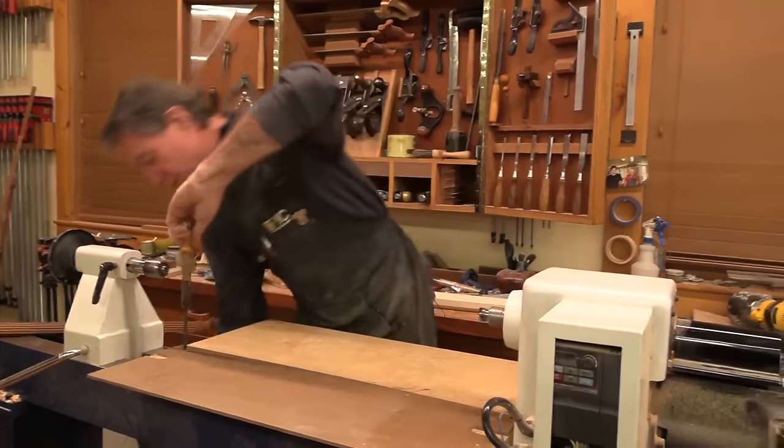So if you wanted to lay out the template, that's what you would do. You would get a center point and you just bring it down 1/4 inch to that outer point. Remember, my rolling pin is 20½ inches long. It's not a set rule, but the longer ones are nice because you can really cover more ground. It's okay if it's not round as much from the end in. So anyway, when you make your template, what I did was I did half of it and I flipped it, and I got it onto this hard piece of masonite. So that got tacked onto my base.